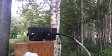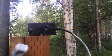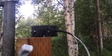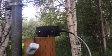Coming out of the tune box and down to this head amplifier — this is the W7IUV head amp, about a 2dB noise figure, maybe a bit less. That drives the signal down 400 feet of RG6 quad.